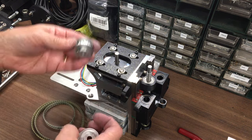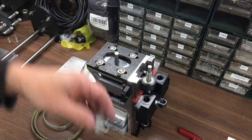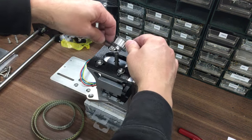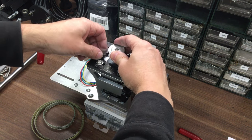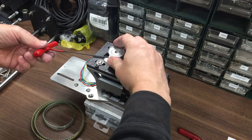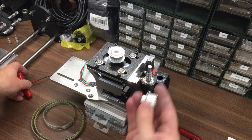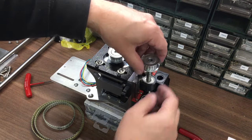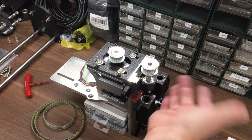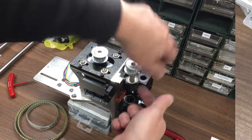Right, let's get these mounted. So there's a flat D on that one. Just get it loose for now because I don't know exactly the final height. Okay. There's no flat on that side, but there's not going to be a huge amount of force. We haven't got the nut on there, have we? Yeah, because these are just some ball screws I had. I might have to machine a nut and a collar, but for now, hopefully it's stiff enough not to move.